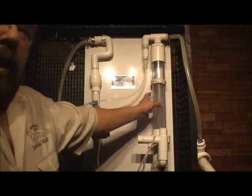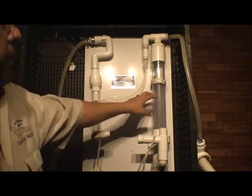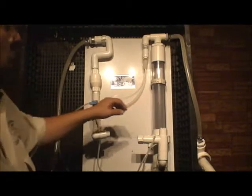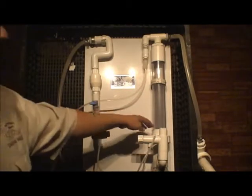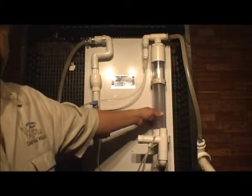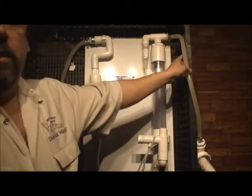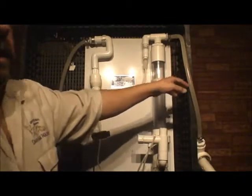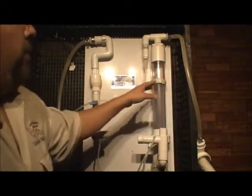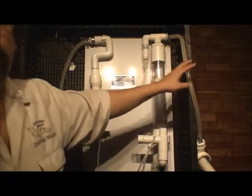Remember that whenever you're going to work on an Olas Ti, you want to use this purge valve to evacuate all chemical that sits within the center tubing, and you want to take your line, whether it's PVC, hard PVC, or tubing, directly to the drain with it. You want all those raw materials, all that highly concentrated solution, to go directly into the drain. You do not want to purge that into an open area that is not well ventilated and not well evacuated of any kind of strong toxic odors.